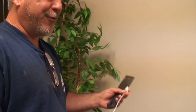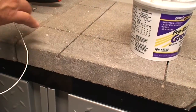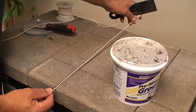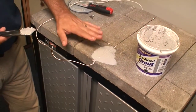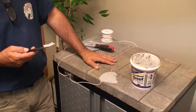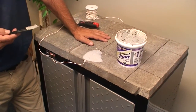One of the more complicated but very viable options when dealing with a concrete floor with glued-down carpet or finished tile work is to take a saw and cut a groove in the concrete. Then simply lay your wire in that groove — it'll disappear nicely. Then get some standard pre-mixed grout, put it on top, and you'll get a nice smooth finish that completely disappears. It's permanent — no fuss. This is going to be a bit messy, especially when cutting the concrete, but it is a great resource when that's the type of flooring you're dealing with.